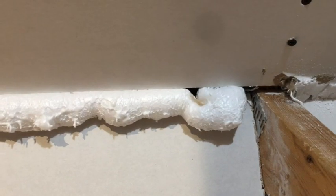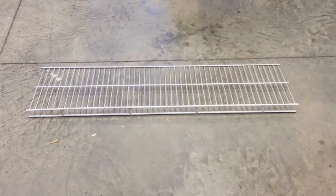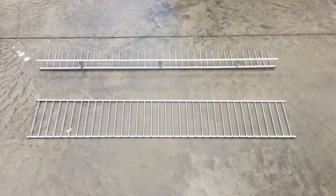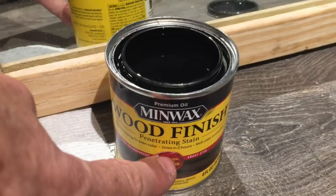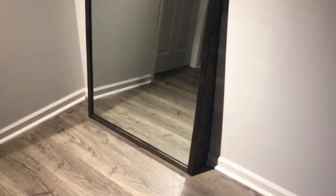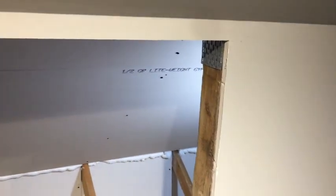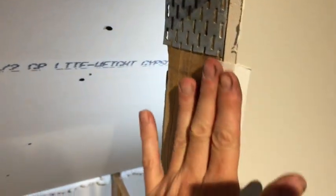Now that my foam is completely dry, I'll cut off some of the excess. We'll add a coat hook on the inside of the door. I'll cut up this wire shelving into two pieces — I've drilled holes on the inside of the door on both sides, and there's the shelving installed in the door. Now I'll put this ebony stain on the frame. I don't want to make this door opening any smaller with trim molding, so I'll just cover up the raw edges with white duct tape. I went ahead and duct taped some of the trusses so they wouldn't snag the clothes.